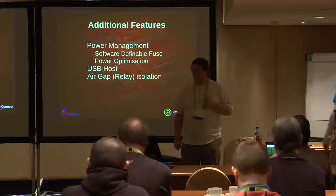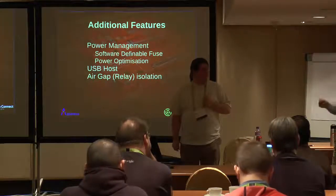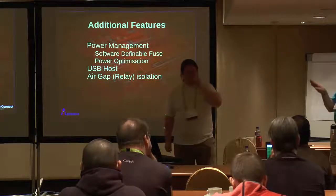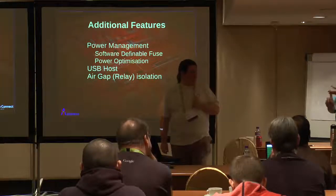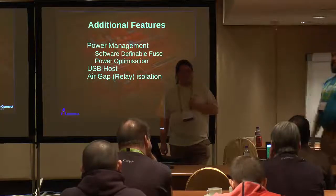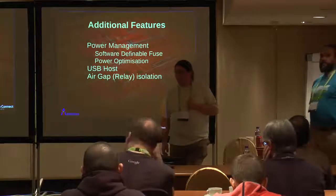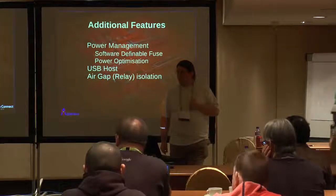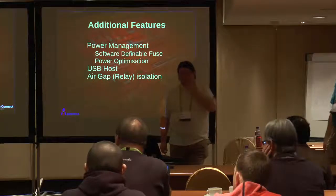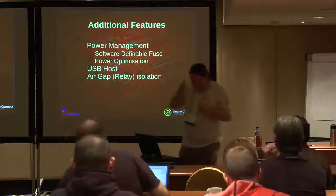So you have to power cycle it again, and sometimes you get it. But actually what you have to do is kill the power to the serial. Even though the red power cable is not connected to the board at all, you've only got ground to RX and TX, it's putting enough power over the RX line that it latches the first stage bootloader. It's a hardware design issue, but it's the kind of thing we see a lot. It's the 3.3 volts on the TTL. It's enough to power the SoC, so it doesn't go into reset. Yeah, so we're actually not resetting the board. Exactly. Yay for low power.